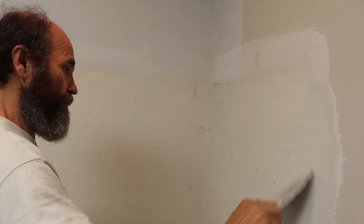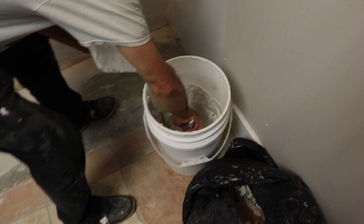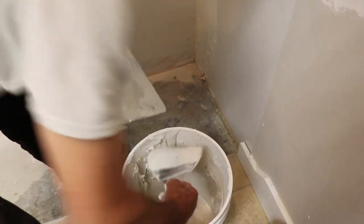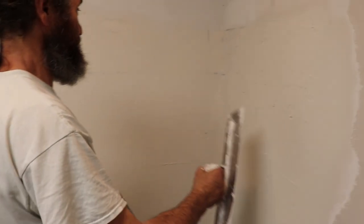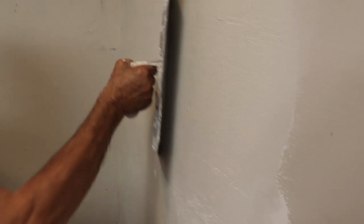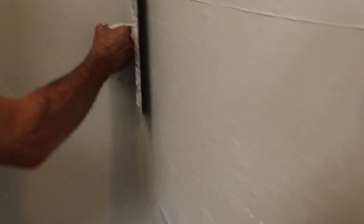We see a few spots — sometimes when you remove the tile, because of the damage over time, we don't see that the paper is loose. I still wait for it to set, but I can show you guys something. Like if you think it is too rough, even before it dries you can go and do another coat — and the holes that you have would help fill in. Because all the time, even if you do it tight, a little bit of mud would stay there. Like you guys can see here — see the difference.